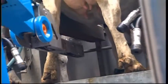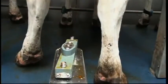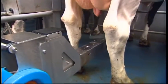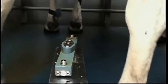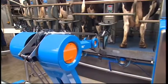The spraying system consists of two nozzles mounted on an axle. During the spraying process, the axle and nozzles rotate through 180 degrees. This produces a tight cloud of spray droplets surrounding the teats, meaning that all surfaces of the teats come into contact with the disinfectant. After spraying, the robotic arm withdraws from under the cow and returns to the starting position, ready for the next cow.